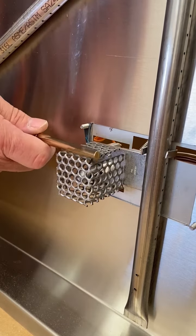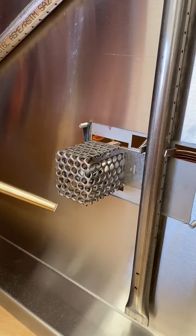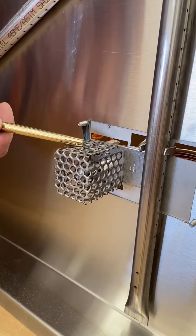We're not going to cover over this. We're going to put our lava rock or our broken glass about a half inch down around it, because we need to get air in there to light our pilot system that lights your burner.